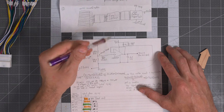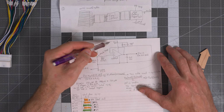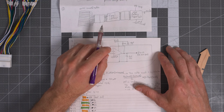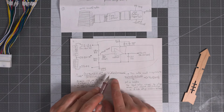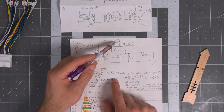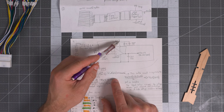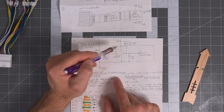We have 36 volts across this poor op amp. There is a 1K that's limiting the, there might be a small voltage drop. Probably not. We could actually calculate that because I did the math here. No, there's almost no drop here. It's millivolts of drop across those. Certainly under a volt. I'd have to use a calculator there. Anyway, we have a diode here.